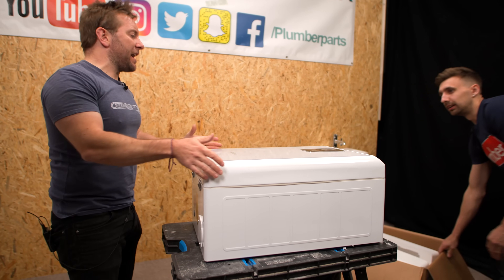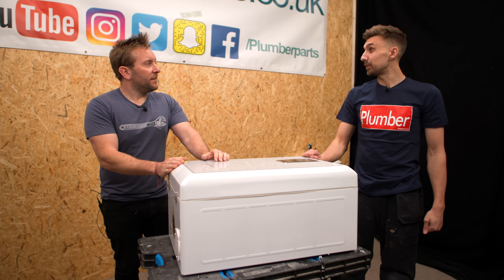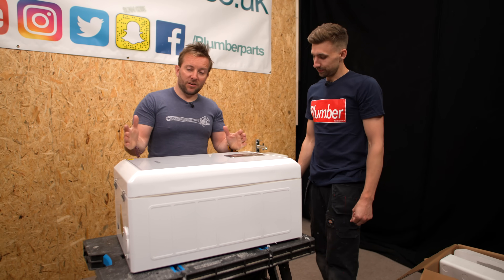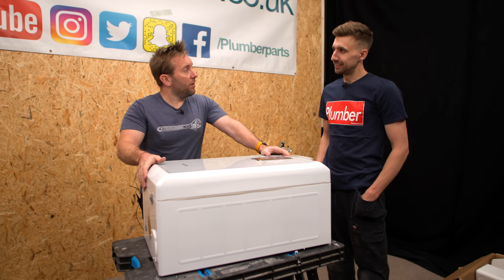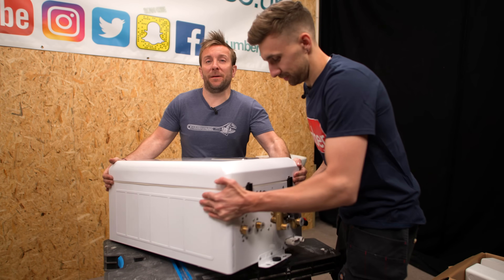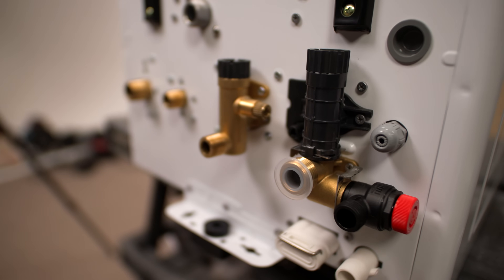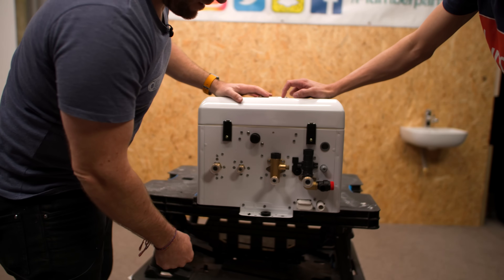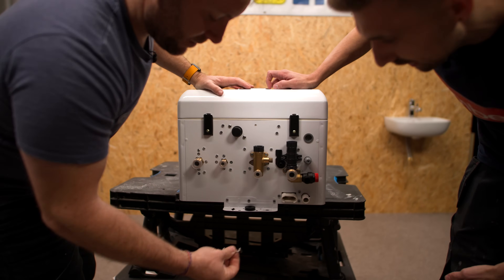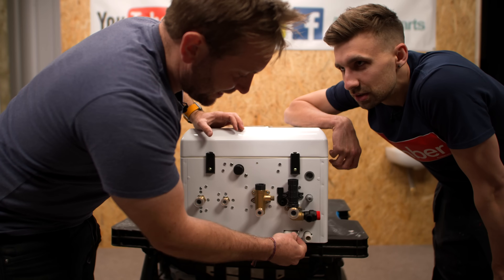Now Josh, how many gas boilers have you fitted in your lifetime? Too many — over 300, I would say. That is a lot. I used to do gas, and that's the reason I've got you here today — you're going to say to me "that's good" or "I'd do something different there." So let's have a look at the bottom of it. The PRV is external, which is perfect — just clip off that. And there's a condense trap so you can clean it out. Easy trap clean. Everyone obviously cleans the condense trap out on a service — they should do.